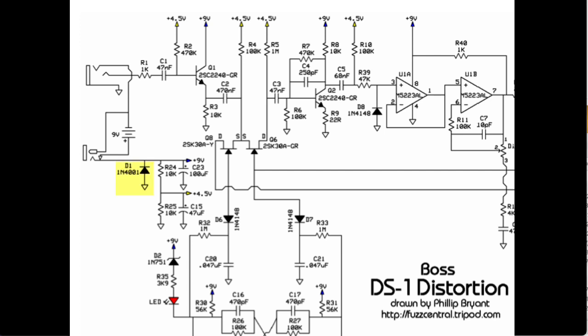It looks to me like this thing would start to get hot. And as it gets hot, maybe it fails. And if this winds up failing as a short, well now you've shorted out your battery, and your battery is going to get even hotter. Or maybe it fails as an open circuit, in which case your protection is now gone, and the rest of the circuit fries. If you can convince me that this is a good scheme, please leave a comment below — let's have a discussion. Because this circuit bothers me a lot, and I would like to feel more at peace with it.